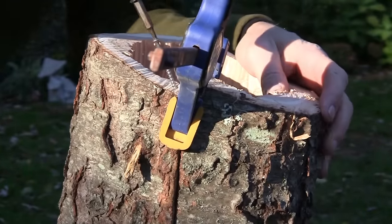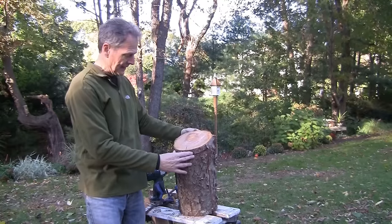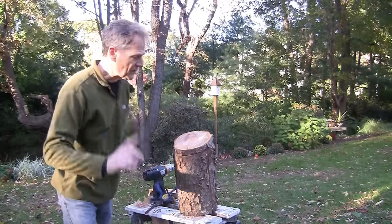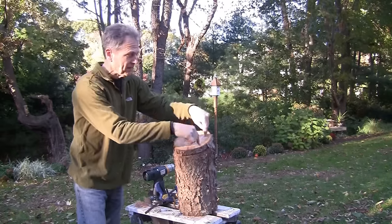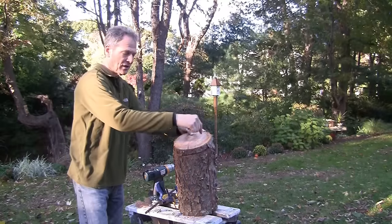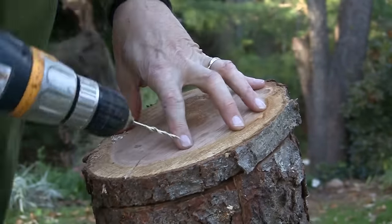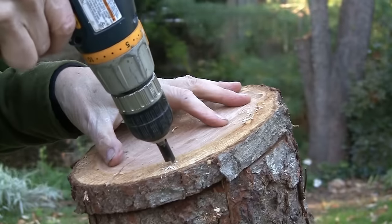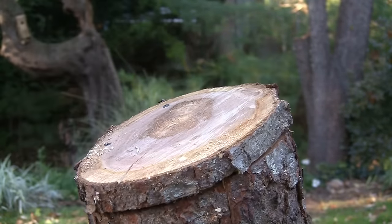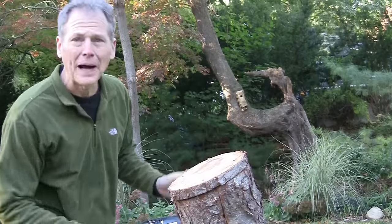It doesn't have to be perfect. I've only got the bottom piece — we're going to put the bottom piece on and find how that matches. Because that was a nice cut, it matches. I'm going to use screws. The reason I'm going to use screws is if I ever want to clean this out, I just hit four screws, unscrew it, and it's an easy clean out. So I'm just going to put four screws, drill and tap them. There you go — bottom is done.